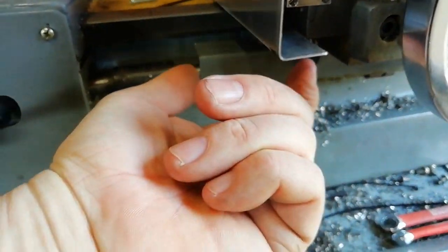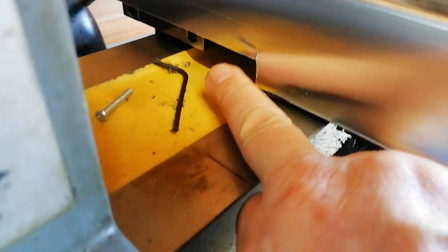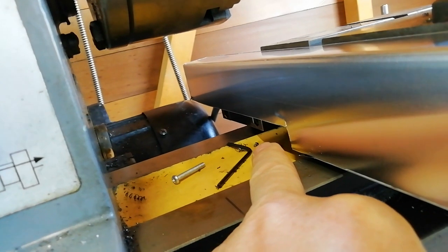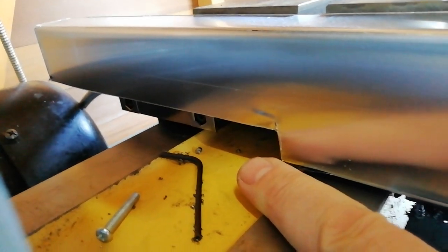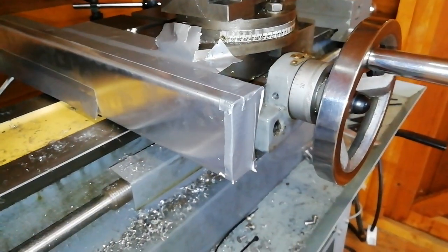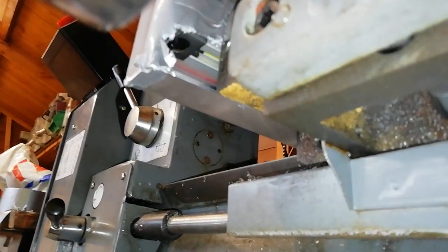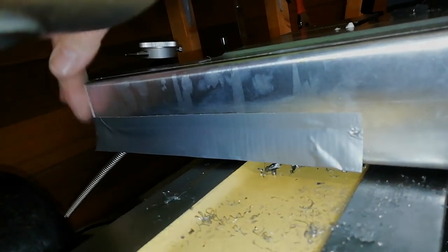It tucks in under the device, which I think will largely prevent splashing. This gap can't be filled with metal because it needs to clear the motor when the cross slide is over towards the back. So I'm going to fit a flexible skirt there so that when the hole is in a vulnerable position the skirt covers it, and when the cross slide needs to be over the motor the skirt gives way — but at that point it's not vulnerable to contamination. Where the engineering stops, the duct tape starts — taped over the end, taped over the back. It's a temporary arrangement. All of that has to be flexible, otherwise it won't clear the motor.